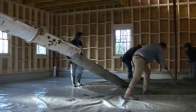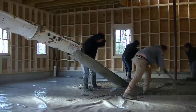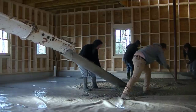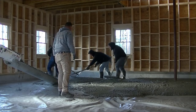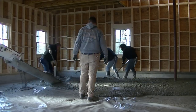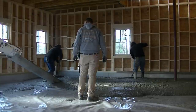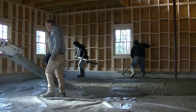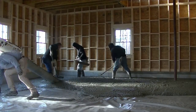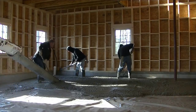The specs on the floor were a four inch thick concrete floor, 3500 psi with microfiber and six mil poly vapor barrier. A lot of people up here just use fiber mesh in the concrete — they don't use much wire mesh and a lot of them don't even use rebar. We use a lot of fibers in our pours, as you can tell from some of my other videos on the channel.